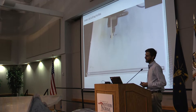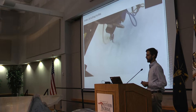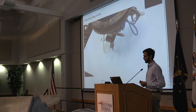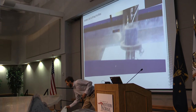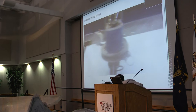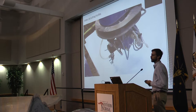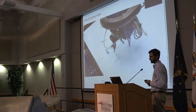Let's get a glimpse of what this machine actually does. In the model, I gave each profile a unique number so that when they were all cut I didn't have any issues arranging them in order. That turned out to be a good idea, although it did leave a bunch of little scraps in the water jet machine. That square is a 2x4 alignment pin — all these profiles fit on a 2x4, and that's how they lined up. The sheets are 4-foot by 8-foot sheets of extruded polystyrene foam that you find in any home improvement store.